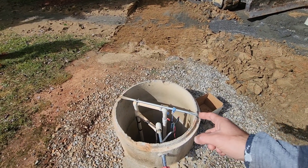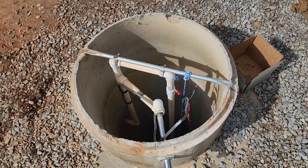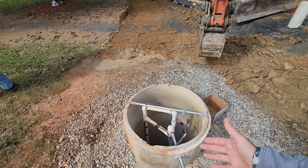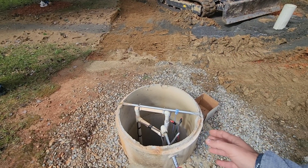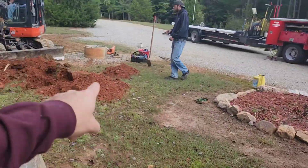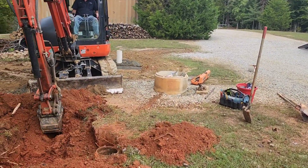That is a drilled well, done with an air rotary machine. What we're going to do today — and the reason for the video — is this pump is hanging on PVC pipe, not the typical black poly roll you see in a lot of my other videos. To pull a well pump out on PVC you have to be really careful because it will break at every connection. Ideally I'd run a brand new water line from the house out to the new well, but the homeowner wants us to tie on to the pipe already in the ground and tie down to the power in the well.